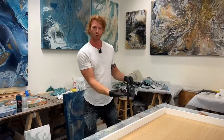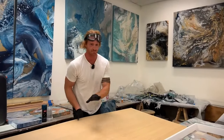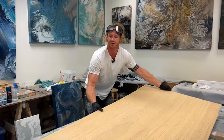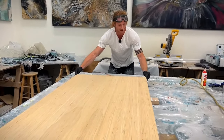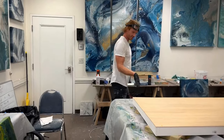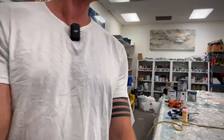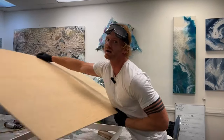Now we take the piece of Luan — the face of the canvas — slide it out but leave the frame behind. Keep it in the same direction and set the face directly onto the frame. Before you start gluing and brad nailing, look at it and make sure all the corners line up the way you want and that the canvas is sized appropriately with the 1x3s. Looking all the way around, it's going to be pretty much on point. I'm going to have to bend it out on one side when I brad nail it, but other than that it's going to be pretty close.